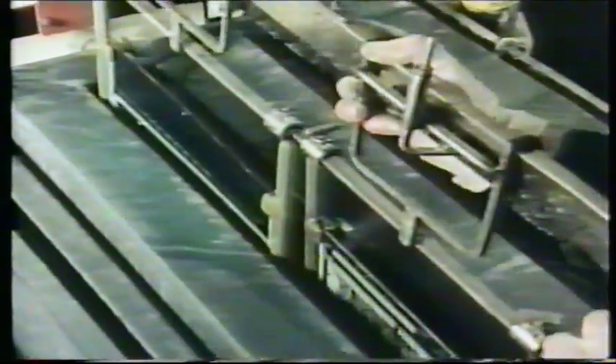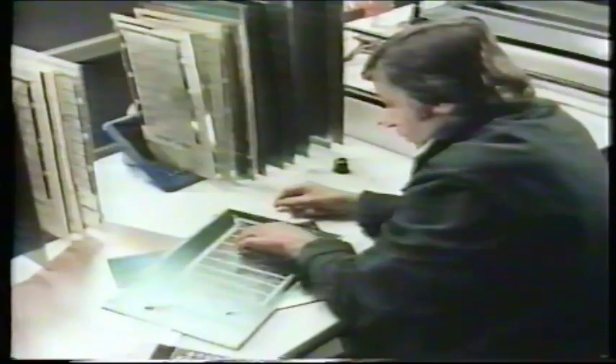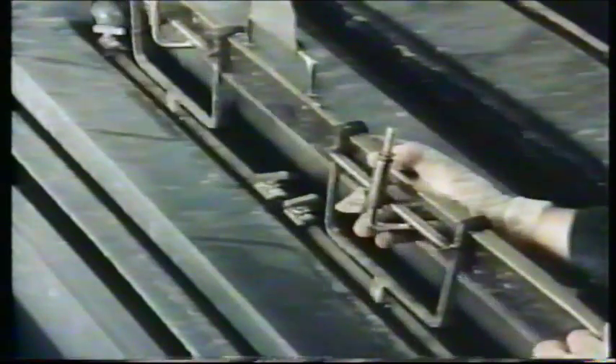The copper tracks on the boards must be pre-treated to make sure they're in a perfectly solderable condition. Ideally, they should be protected with a solderable coating, applied to both the copper base and to the leads of the components, and must be carefully defined. Coatings of pure tin or of 60% tin, 40% lead alloy — say between 5 and 10 micrometres thick — will give the best retention of solderability under a wide range of storage and service conditions, even in humid atmospheres or those contaminated with sulphur. Coatings can be applied by electroplating, by flow melting — that is, re-flowing after plating — or by hot dipping and air levelling. Fusing a plated coating, as in re-flowing, will make sure the substrate has wetted well and will have good solderability.